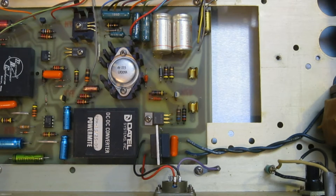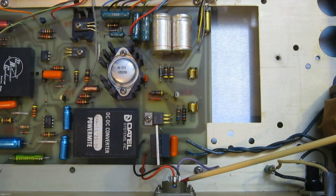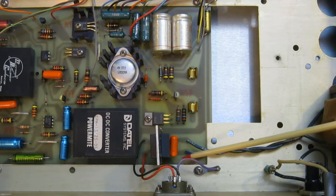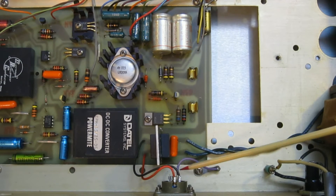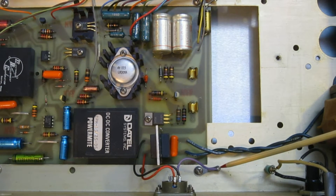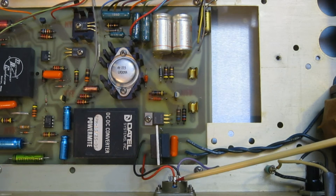For that, I remove the top cover again, and we'll see here is where the key was. The top one is positive. The one next to it is negative. The polarity of this really doesn't matter as it goes through a bridge rectifier, so either way you put your supply voltage in, it's going to work the same way. The other pins are unconnected. This one is for the earth ground — we don't really care about this one right now. So we'll just connect these two up and take a look.